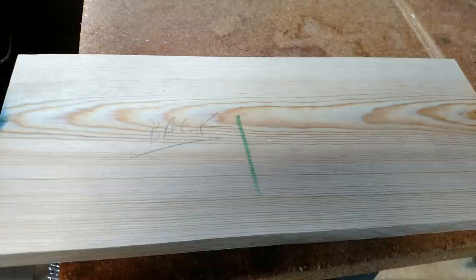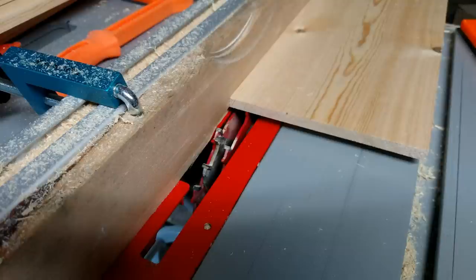After you cut the four boards, what you'll have left is about a 16-inch piece — save this for your back board. I might change the design in the future, but for now I used that scrap for the removable back panel. I then took those boards that were six and five-eighths by nineteen and seven-eighths and put a three-quarter inch by three-eighths inch rabbited edge on each edge of each board — four rabbited edges total across four boards, and that's going to be for two boxes.